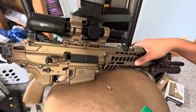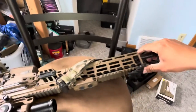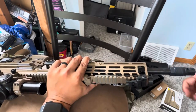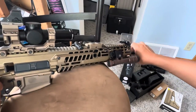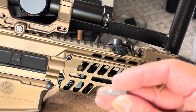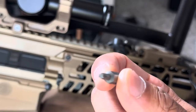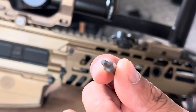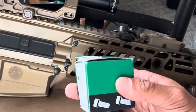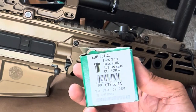With Torx Plus and the correct Torx bit, you'll get your full 45 inch-pounds of torque on each side. Once you do that, your barrel is going to be rock solid — no more flex. So: Torx Plus, not Torx. There is a difference. 15 IP is the Torx bit that you want. Torx Plus has squared-off lugs, not sharp lugs. From McMaster-Carr: 8/32 by 1/4 Torx Plus button head cap screws, black anodized.